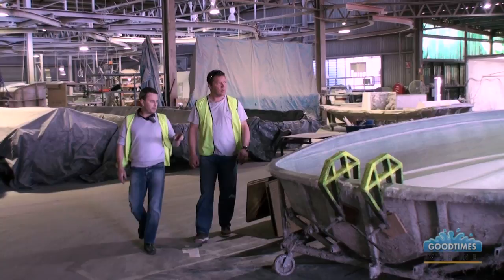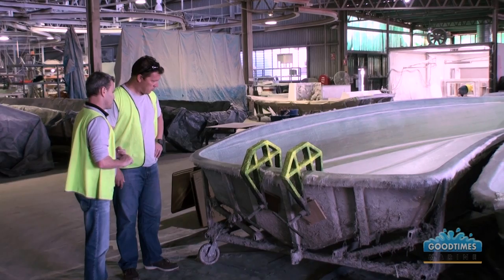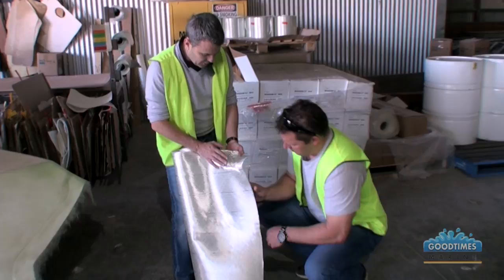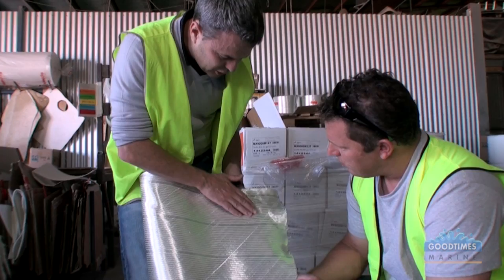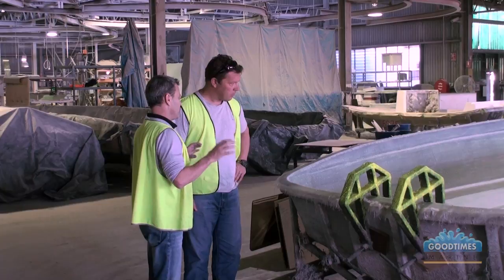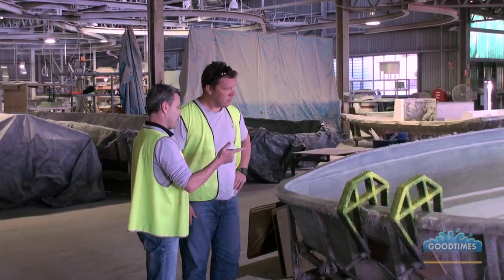This particular hull is the 602 hull that matches up to the deck we just saw being made. It's had the skin laminate put in and then its reinforcements. We use a lot of knitted fabrics and there's a lot of hand-laid glass. The skin plus reinforcement consists of double bias, 24-ounce woven rovings, and 450 GSM chop strand mat — all laid onto the gel coat. Once the skin laminate cures and is checked for air, the second stage is reinforcement glass, which is where this boat's at.